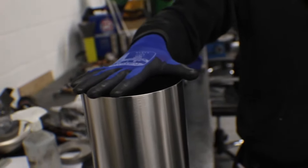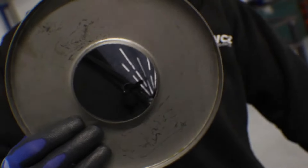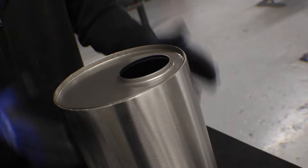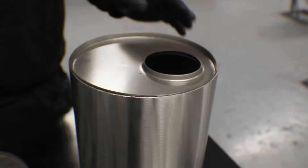We've got two to make — one six inch diameter silencer and one eight inch diameter, so this is a big one. In terms of offsets, we offer three different kinds: a center-to-offset, a diagonal offset, and a parallel offset. A center-to-offset is where we use a center hole baffle on one end and an offset hole baffle on the other end, so the tube runs straight, two bends, then out at an angle and straight again.